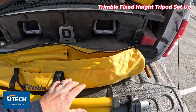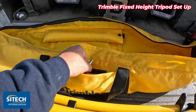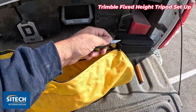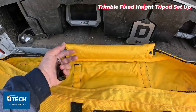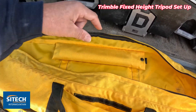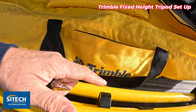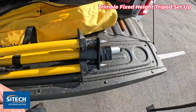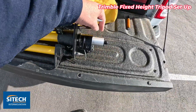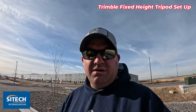One thing is when you put it in the bag, I usually take the point off right here and put it in the side pouch, because when it's on and it's in the bag it usually tries to poke out the other side. Also remember that in your bag you have an extra meter of extension that you can put on the top right here. I'm going to go through a couple of setup processes and things to watch out for — like your bubble — and also, since it's in meters, I'll show you how to key in specific heights on the base when you're not sure what the conversion is.